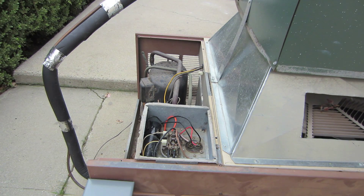I'm going to show you the difference. On the 240-volt side, if you have brownouts, a split system on different panels, a loose breaker in the panel, or people tampering with the breakers, the conventional time delay is not going to help you out at all. The only benefit at that point would be to put a Sure Switch in, because a conventional time-delay contactor isn't going to help you.